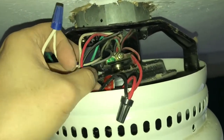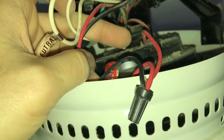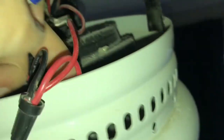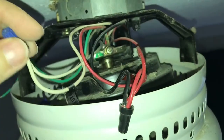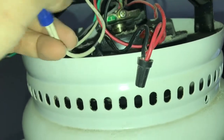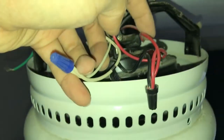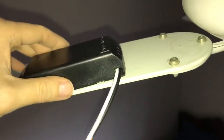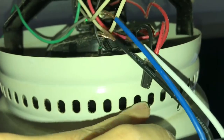Because this electrical setup is using the same switch for the fan and the light. So this is gonna be neutral out in, and this is gonna be hot out in. So I'm gonna connect this neutral and hot right here, to the neutral and hot in right here. So the rest will go out for the wires with the label.